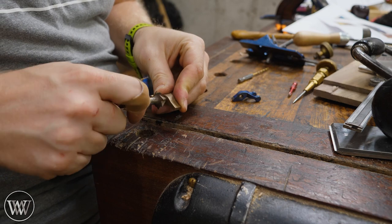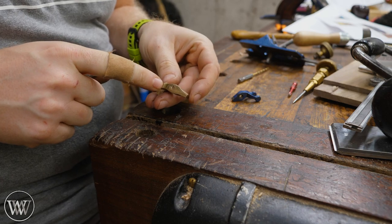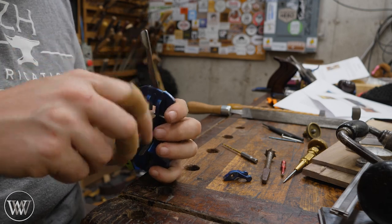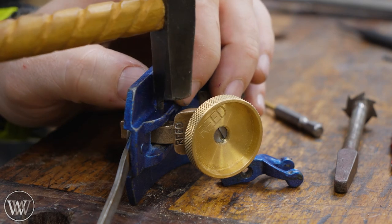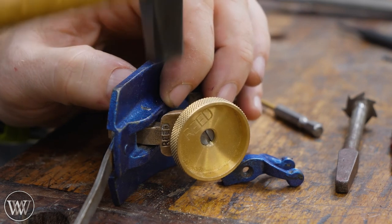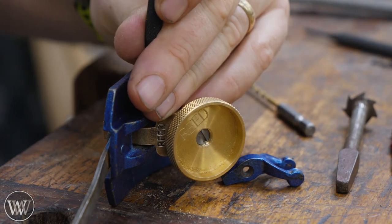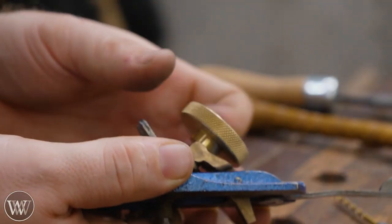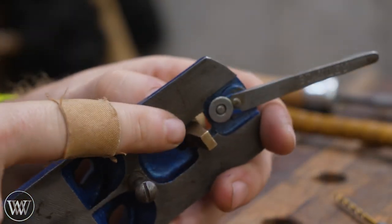After drilling, I come in with a little reamer to clean it out, get rid of the burr on the edge, and we've got a really nice hole ready to fit the pin. With all that done, we wind it all back into place and get ready to put that pin back in the slot. Be very very careful — light taps, make sure it's lined up nicely with the yoke — drive it down until it's flush and maybe come in with a punch for just a hair of a blow.